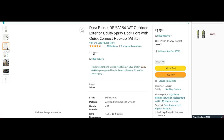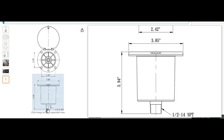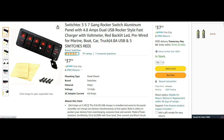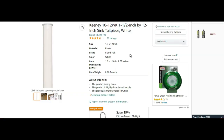Here's my connection for the outdoor shower and also for the bathroom — this is how I avoided giving up interior space, because my water heater is hooked up here directly and I use the water heater temperature setting as my mixer. Here's what I use for my water pump and all the different accessories — I had really good results and it was very easy to connect. These are the straps I used: sometimes you can't screw into a component like the water tank, so I strapped my 12-volt water pump to the tank — it comes with all different attachments included.